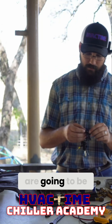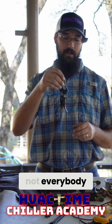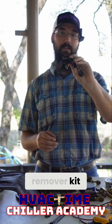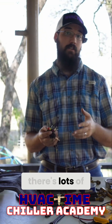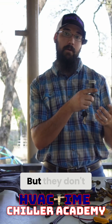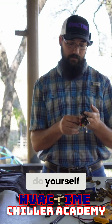Some additional items that are going to be more specific to the chiller side. This is a terminal remover kit — it's for Molex connectors. When we have Molexes, there are lots of sensors that the factory will ship with the pins already attached, but they don't ship the plug — the plastic Molex plug piece that we plug into. That you have to do yourself, and so you need this.